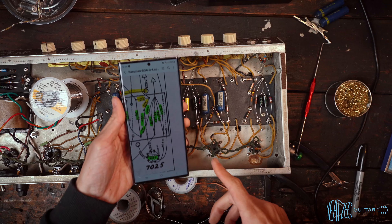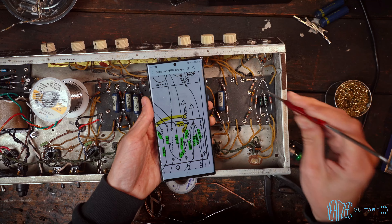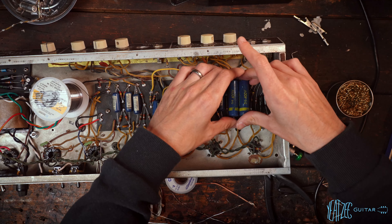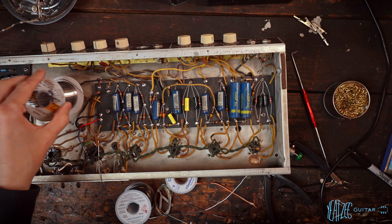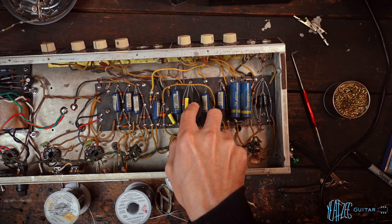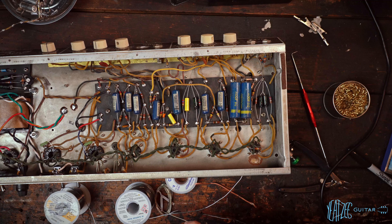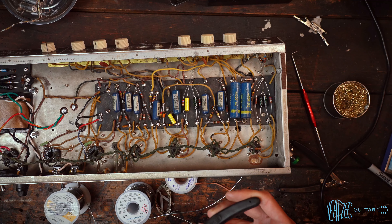Let's check our work so far. We just got to connect the blue molded stack to these three eyelets, and this whole section is, as far as I'm concerned, done — with the slight caveat that yes, I might have to come back and replace some parts. That basically covers the entire circuit board. There's still some debris all over it — we're going to have to use some compressed air to get rid of all the little bits of metal and solder. This entire amp is probably going to take a whole can of compressed air just to clean it out. There's so much old solder and just little bits and pieces of metal everywhere.